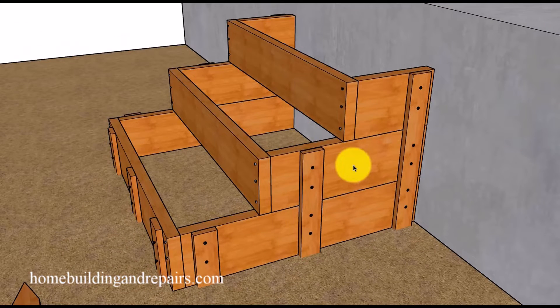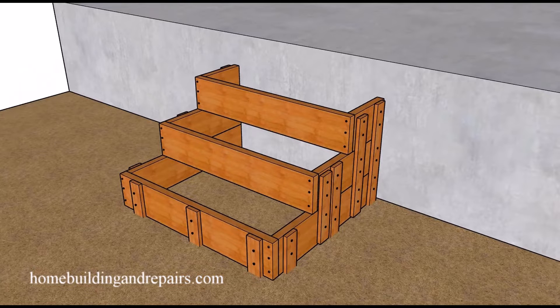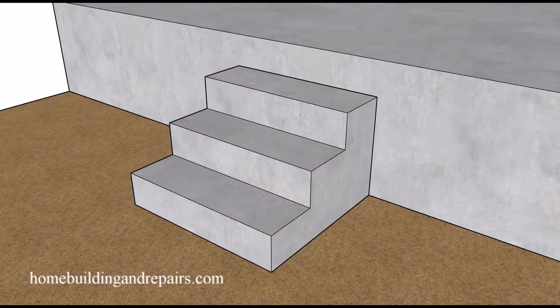You might be able to drive a nail or screw at an angle to firmly attach boards together, and you can do that on all necessary sections to prevent movement. Or you can grab another board and attach it to create a nice connection. You don't need to do this if you're satisfied the sections won't move when pouring concrete. You can drive more stakes into the ground — even one, two, three stakes — because the last thing you want is the form boards moving while you're pouring and finishing your stairway.